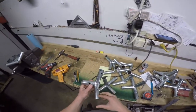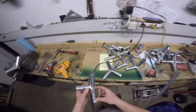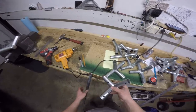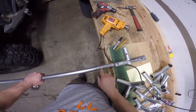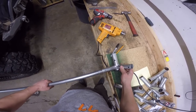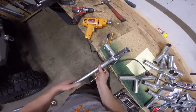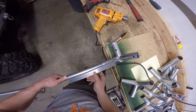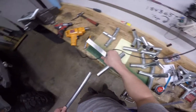I figured out what the shortest one was, and long story short, it worked out that if I set them all three inches off the bottom, I can make them all the same. So what I did is I took this pole and marked one, two, three, four, five on there, and when I put this in I can see where the mark is. Then I take my ruler and say the four is showing — I can measure one inch in from the four and mark that, and I know that's three inches off the bottom. So I went through all of these and marked them three inches off the bottom.